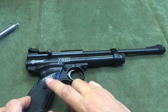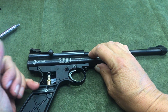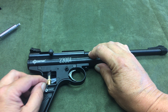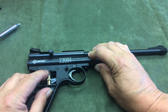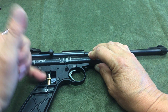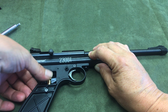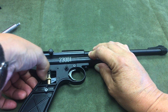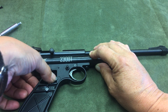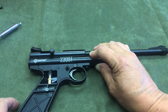With a straight-bladed screwdriver, you can go ahead and remove the grip screw, and then take off the grip panel. This will expose the trigger weight adjustment mechanism. What we have here is a spring sitting on a caster. A portion of this dial is threaded. So when I turn it this direction, I am raising this up, putting additional tension on the spring and increasing the pull weight on the trigger. When I spin it back the other way, I am relaxing tension on the spring and reducing the overall trigger weight. So once you're familiar with the pistol, this is something you may want to go in and tune to suit your particular taste or needs.